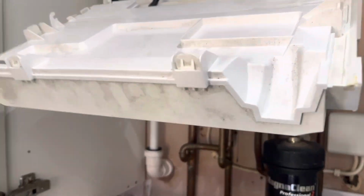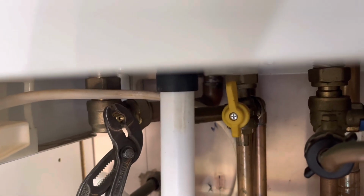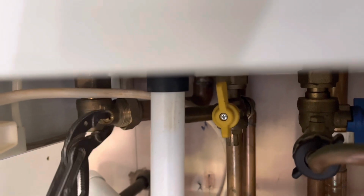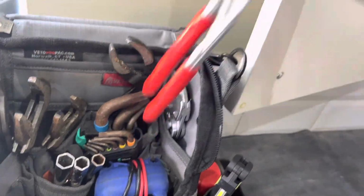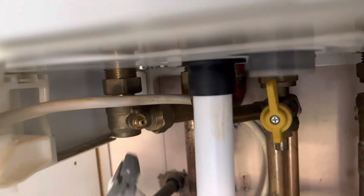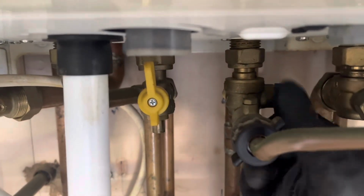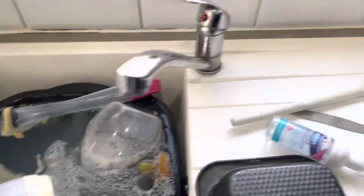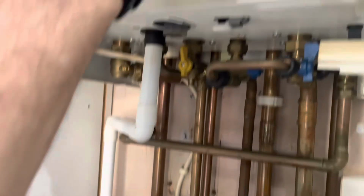We're just going to crack on, start getting this strip down now. Let's go. So when I'm doing these boilers especially, it's a nightmare. I like the Ideal Logics, but they never shut off properly with the plastic valve, so I'm just going to get that freed up, and that's off now. Get the plate out now. I'll drain the heating system and put the chems in via the filter there, which makes it easy for me. So it's not so bad.